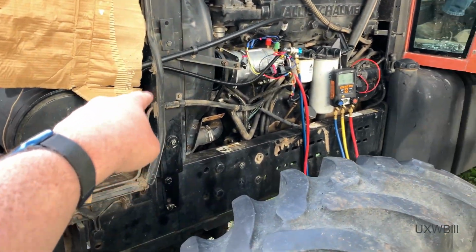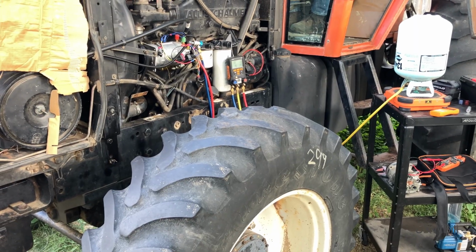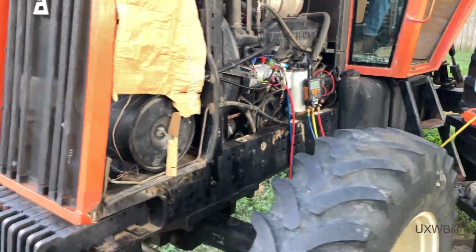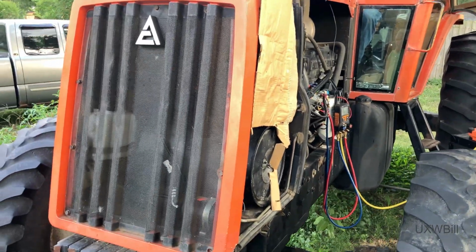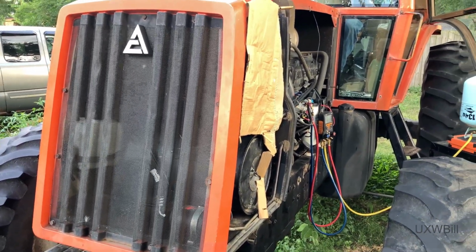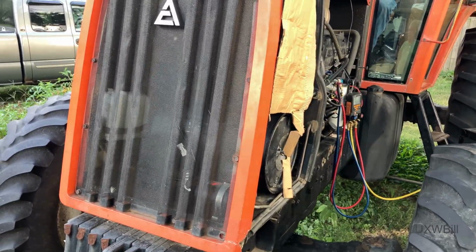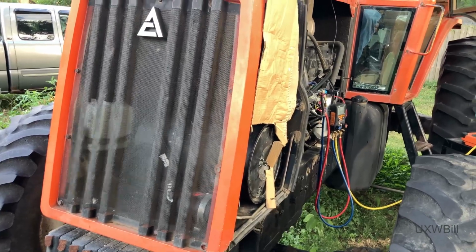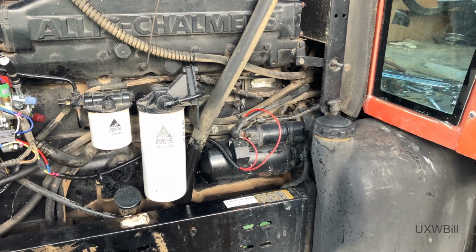And as far as the leak in the hose is concerned, we'll just have to see how long the charge lasts, and we'll have to see how the tractor does. I do think, from having felt the condenser coil, even with this restriction on it, that another helper fan would be good if only there was room. And I had thought that maybe we could do a pusher fan on the front, but I just don't think there's any way to get it behind that grill.